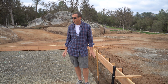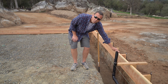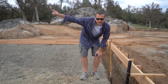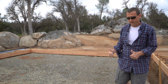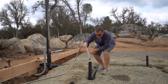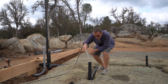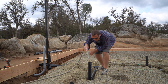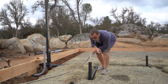Okay, that's how the whole system works. Now we're going to do the test with water. We've removed our caps so the air can escape as we fill it up. Once the water is up to a certain level we'll cap them and then keep filling all the way to the top of that 10-foot pipe. As long as there are no leaks at any of the joints, we know we're good. Let's get to it!